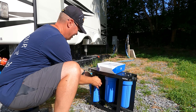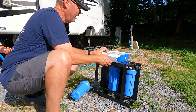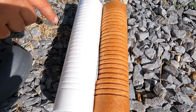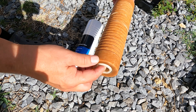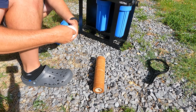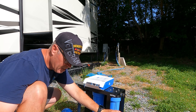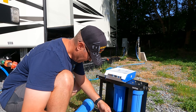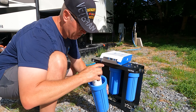We do have to give a big thank you to our son Craig, who purchased this for us for Christmas — that was awesome. This is the five-micron rust filter, and after six months of use, that's what it has filtered out. That's part of why you need something like this, because if not, that stuff is in your water. We don't necessarily drink the water out of the tap even with the ClearSource filter in — we'll make coffee with it — but do you want this stuff getting into your water heater and anything that uses water, potentially causing more problems down the line? The bucket is clean — look at that, it shows nothing. The filter's been doing all the work. This is the 0.5-micron carbon coconut shell carbon block filter — actually, that doesn't look too bad compared to the new one, but you can see a little bit of a difference.